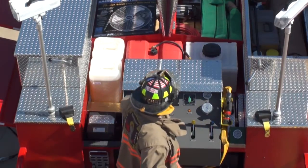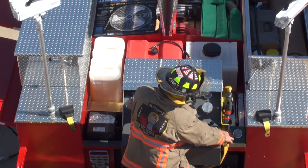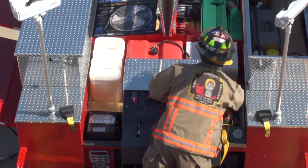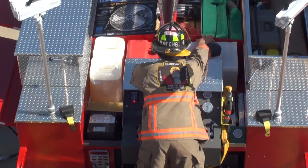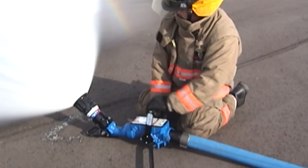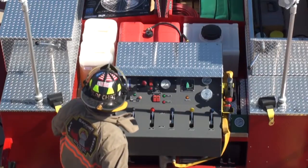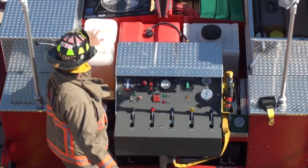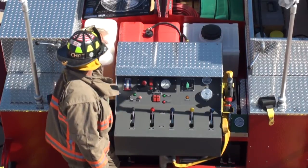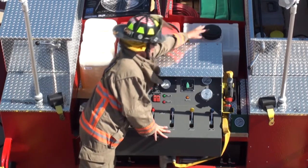If you order the 35-horsepower pump, you can put on the two-and-a-half-inch pre-connect with its gauge and control lever. This tray holds 150 feet of two-and-a-half-inch hose pre-connected to your monitor, blitz nozzle, and the hose bed. Behind the pump panel is foam storage — it carries two five-gallon cans of foam — plus the gas tank for the generator and pump, and the foam tank.